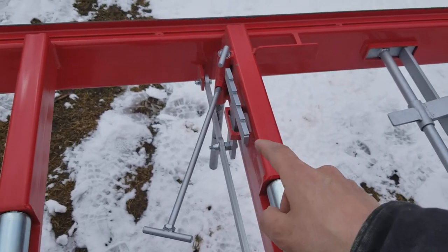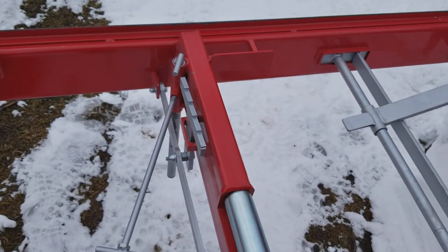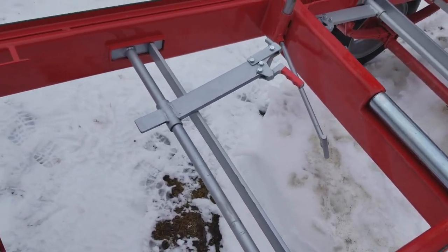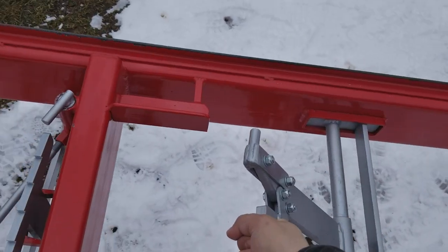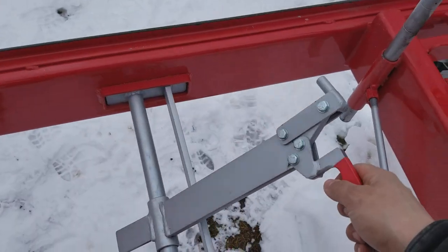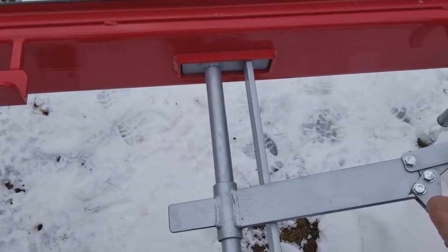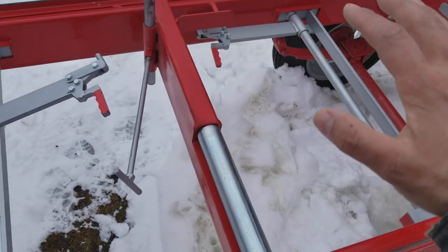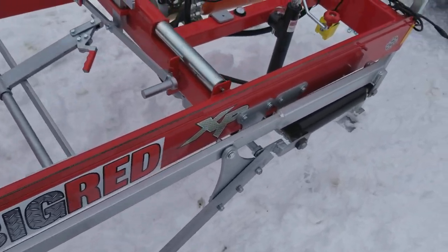Something really awesome about this mill is there are four of these, so you can mill two logs at the same time as long as the total length doesn't exceed 24 feet. For example, you could have two 12-foot logs, or a six-foot and a ten-foot log. The cam lever action holds the cant in place - when it's down it's perfectly flat, when it's up it's at the perfect height to hold the cant against the frame for a perfect one-inch board, down to three-quarters of an inch.